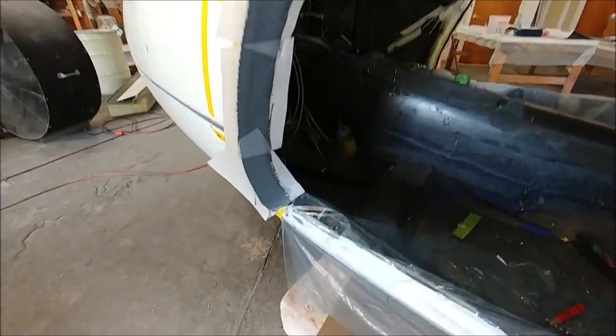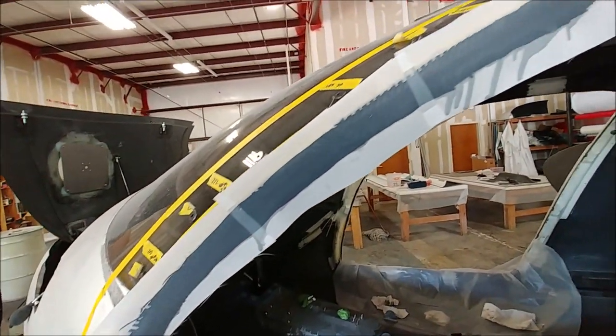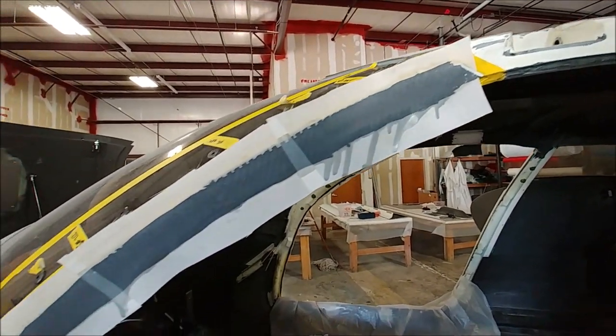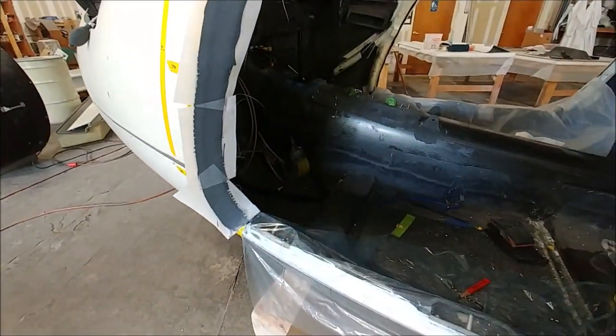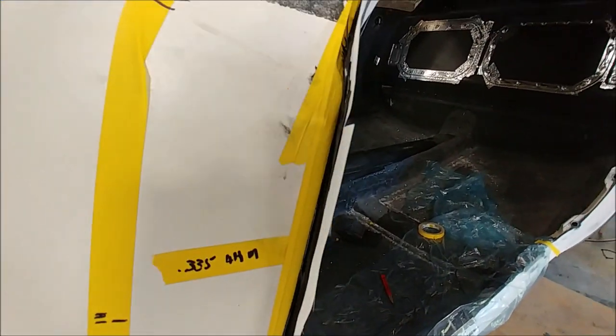Skipping right to showing you the peel ply on the other side — again, a similar amount of layers put down there. I think it was up to six at the bottom, and the other one had up to seven layers of heavy, which ends up being about almost a quarter of an inch altogether. You can kind of see the thickness on the side underneath the peel ply.